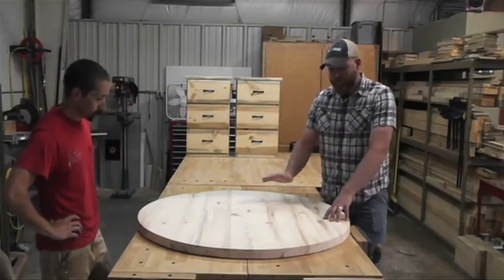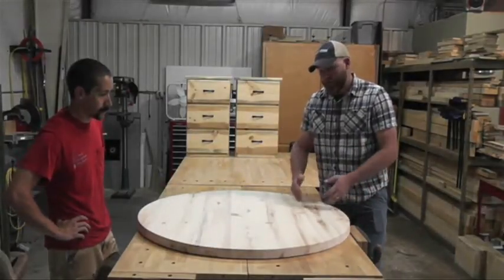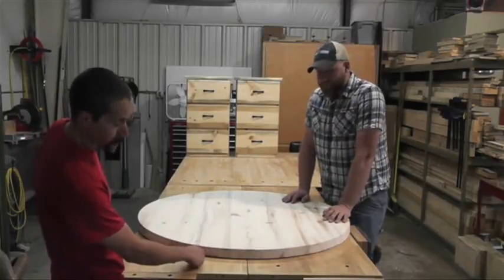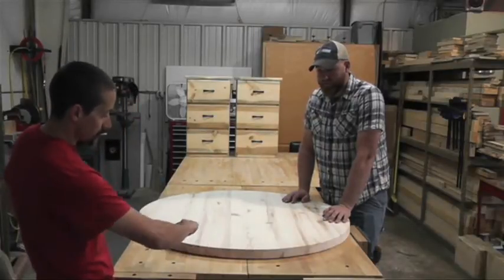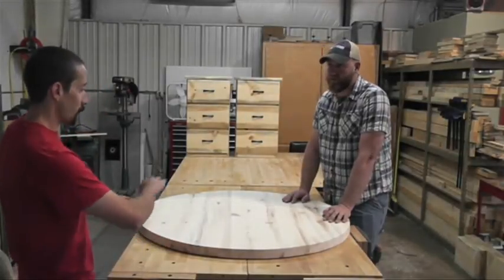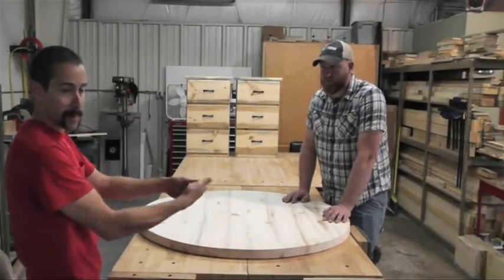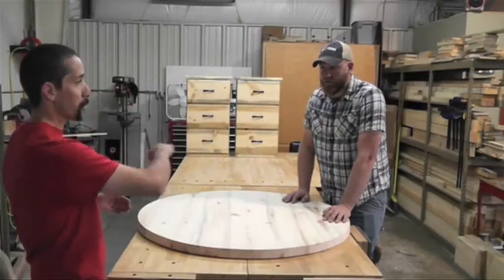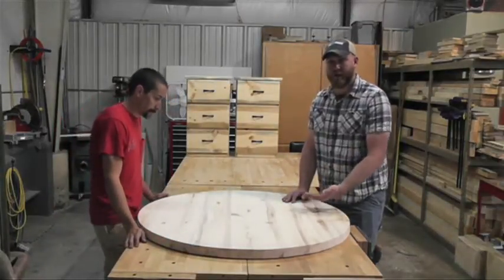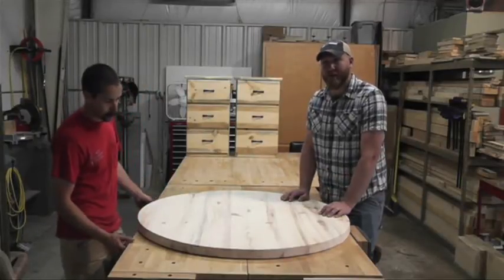What we did was we used five-inch boards on every single board instead of using the entire board, to narrow them up a little bit. I also alternated the grain — you look at the growth rings on the back end and when they go one way, the next one over you want to have run the other way, just to keep it from warping. It's a small sacrifice because usually I pick the side with the most color and put that side up, but it's important to have a little bit less color in a flat table than to have a lot of color in a rounded table.